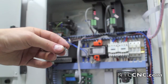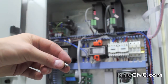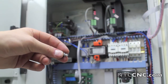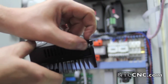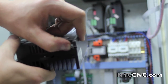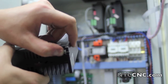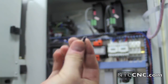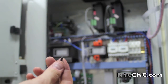Fun fact: the two screws that hold in the old driver were really short — it took about two turns before they were out. Dropping one of these in the electrical cabinet can be a fun game of hide-and-seek, so be careful when you unscrew them. The new driver's panel bracket is slightly thicker, and the existing screws are not long enough to thread in. These appear to be M4x10 threads. I had extra socket head cap screws with sufficient length, so I'll just swap those out. If you're planning on doing this, have some extra M4x10 metric screws on hand.